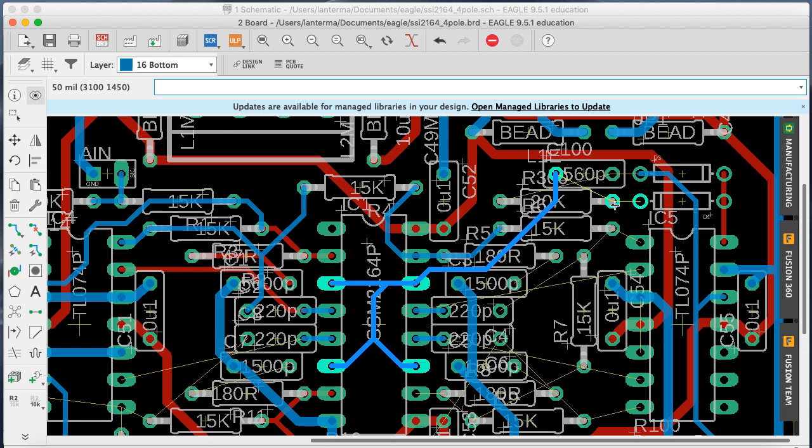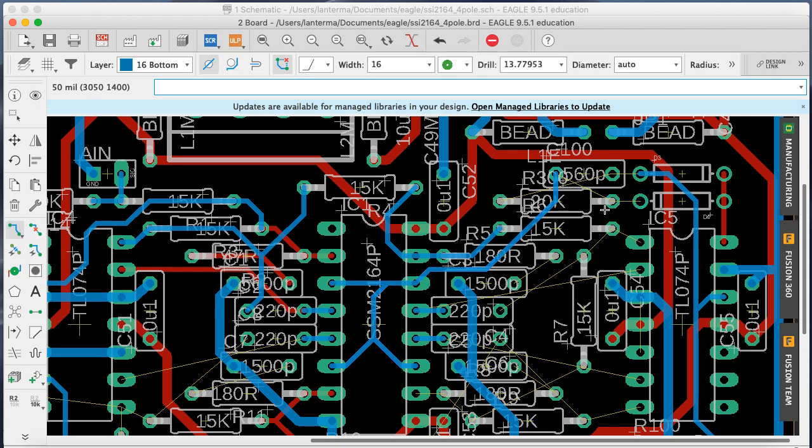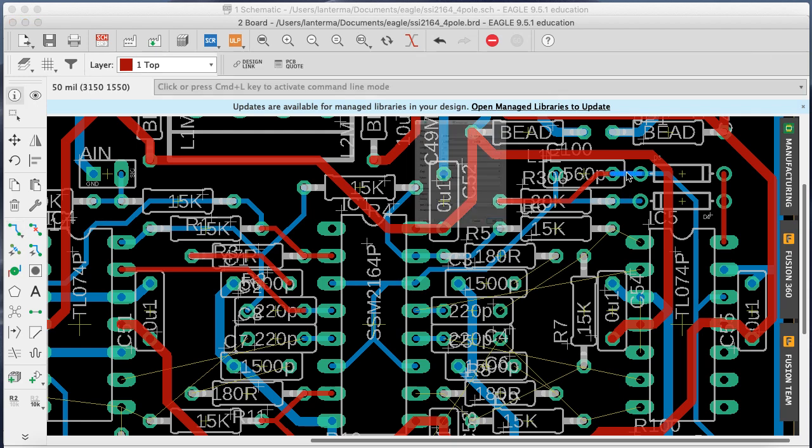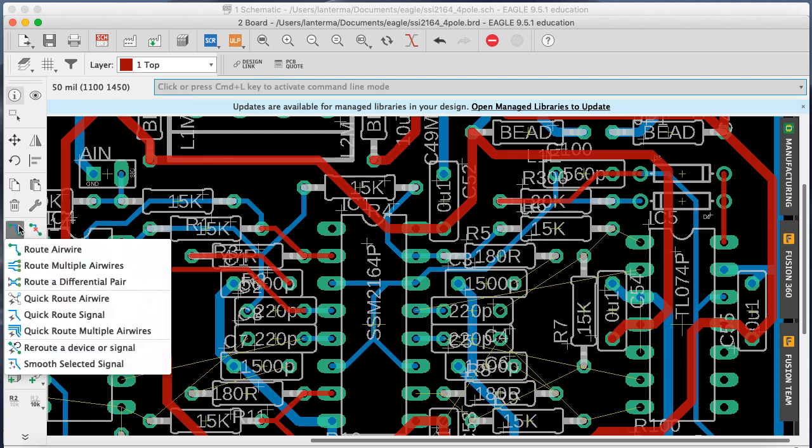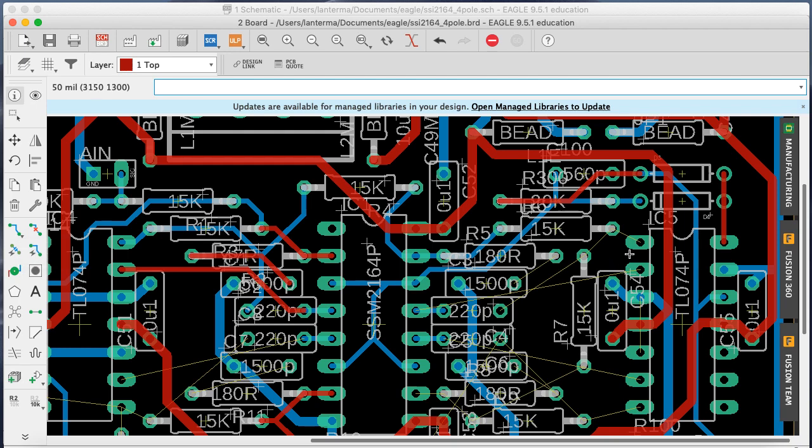All right. So let's go here. Sure, like that. Sure, like this. I could switch to red here just to cross that in the most convenient possible fashion. Or I could have routed around it. Either way would have worked. For continuity's sake of following what's going in here, I'm going to switch this to red. Don't have to do that, but so it's sort of clear if you're looking at that side of the board that these are indeed trying to make a connection. You can see that without having to flip the board over.